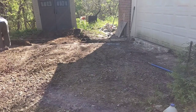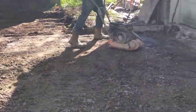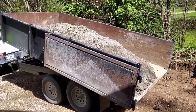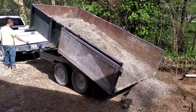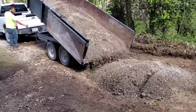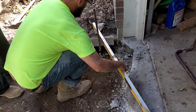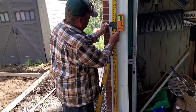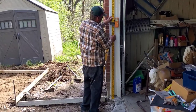It's the next morning, 8 a.m. We've got to compact what was underneath to begin with, and I'm running some string lines. I always compact a whole bunch, then after we get a rough grade on that we add our reclaim road base — basically ground-up concrete. Josh is setting the height on the string and my dad's double-checking it with the laser.